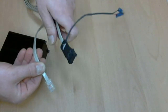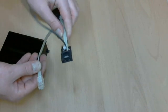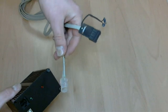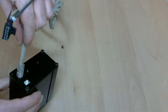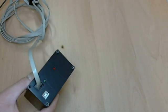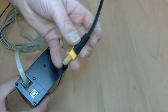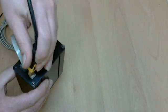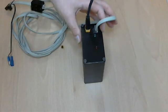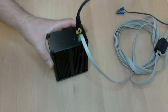This is the sort of cable I can make up — bog-standard flat RJ45 compatible stuff. This RJ45 plug goes into an MTM 800 or Motorola DM series radio, but it could be adapted for a Kenwood handheld or anything else. You've got your RJ45 lead that plugs into there, and a standard USB type-B plug — the sort that goes into printers — that plugs into the interface. That's it, that's all the hardware setup required. Everything else is done via software.